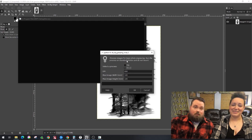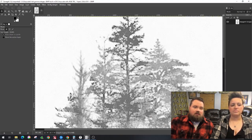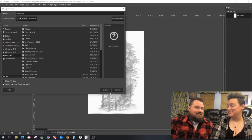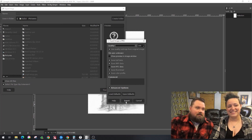This is the photo we pulled off the internet — just a test photo that looked super cool, so we wanted to see how it burned. We're running this through as wood, which means it's not going to invert it at the end. We're running it at 600 DPI, and I'm putting in a test size just so we can get an idea of how it looks. K-40 needs it saved as an SVG and we can't save it that way from the GIMP plugin.